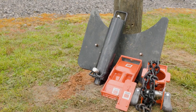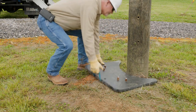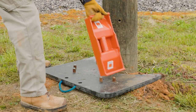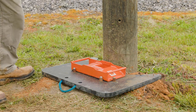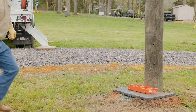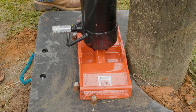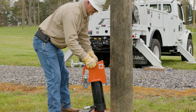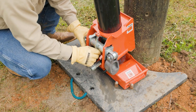Now, let's look at setting up the Husky Tiger Pole Puller. If using the optional pole puller pad, place it on level ground or properly leveled material with the curved portion around the pole. Set the base plate in between the four bushings on the pad to prevent the unit from sliding while pulling the pole. If the optional pad is not used, set the base directly on suitable materials which can keep the base from moving. Place the curved ram end of the cylinder on the base plate centering mount with the cylinder upright and the couplers pointed away from the pole. Slide the swivel plate assembly down the cylinder until it rests on the shoulder at the base of the cylinder. Raise the chain hook swivel bar and confirm the latch hook locks in place.